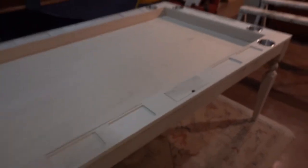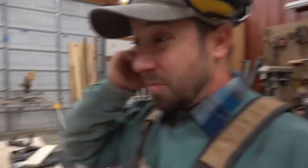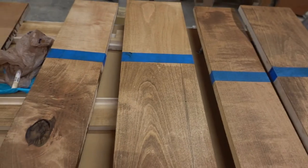The client is super happy with it, but maple — especially soft maple — is known for being blotchy. The table was looking great, and then I went to make stain samples and we were both like, 'Man, this sucks.' I don't normally do a lot of staining. I build furniture out of hardwood like walnut and cherry and usually just do a spray or oil finish, but they wanted a stain, so I'm going to do it. Maple gets really, really blotchy with irregularities, and these aren't even the bad samples.